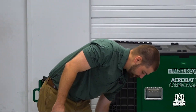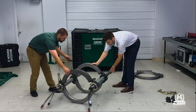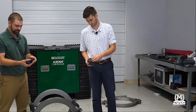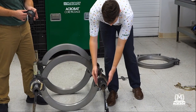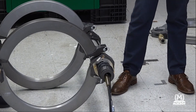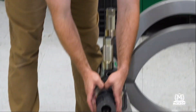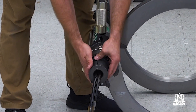Once we have these two inner movable jaws clamped into place, all we're going to do is take our guide rod sleeves. Robbie, if you can grab one of those and show everybody what it looks like. What's the importance of these guide rod sleeves? It's just going to set over our guide rod and allow our jaw brace something to brace against — that's going to help with the connection of that fixed jaw support to the actual machine and give it something to butt up against. You'll notice these guide rod sleeves have a connection at the top — keep that connection at the top of your guide rod so that gravity keeps it on there; if you flip it to the other side, it wants to fall down.